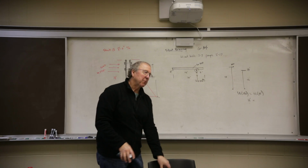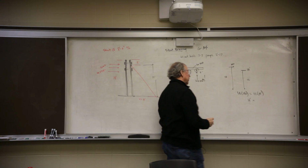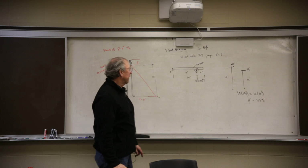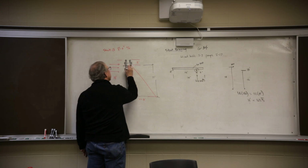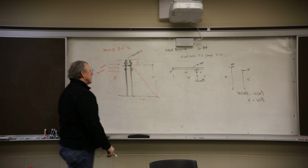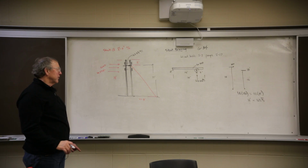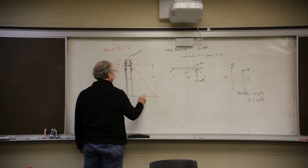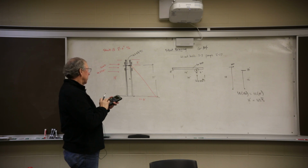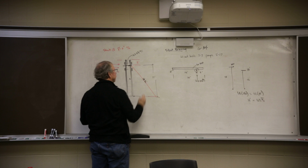Just finding the reaction of a simple beam. If I take 14 times 140 and divide it by 12, I get 163 and a bunch of threes. So take your pick. If you like their way, do it their way. If you like my way, do it my way. So right here, I've got a force pushing right there. Now, remember, forces are exactly proportional to dimensions. So I have a triangle right here, 12 foot tall, 8 foot wide, with a diagonal of, using the Pythagorean theorem on 12 and 8, 14.42 feet.